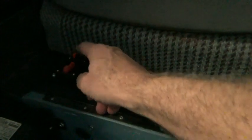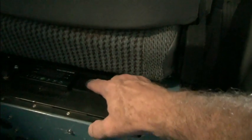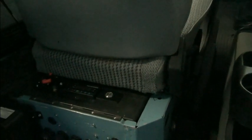Right here we have the solar charge controller. It's a 60 amp controller, and we have a 60 amp circuit breaker right there. You'll see that we're going to be using that as a switch. This is what's going to switch the power on and off from our solar panels, so we can disconnect the panels from the solar charge controller. We have a JLD 404 right here that will monitor the current in and out, so we'll know the state of charge of our batteries. And we have a little push button switch here, which is not to show anything, it's to turn on and off the power to the JLD 404. So when the system's not being used, we don't have the drain off our 12 volt battery from the JLD 404. So that's what you see.